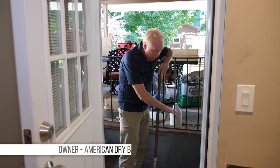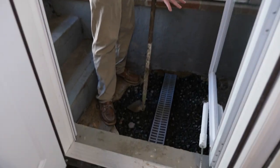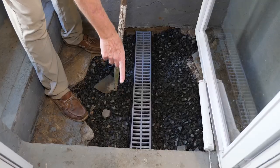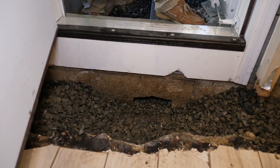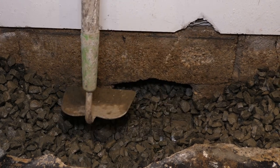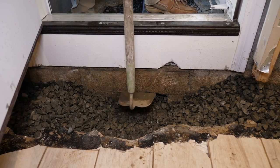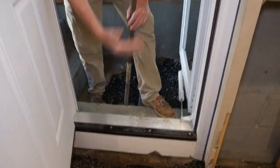What we've done is we've taken a whole big chunk of the floor out here, dug down, and filled it with an enormous amount of stone. Then we set up our speedy drain that goes through this step to the inside, tying in with a T right here to our system. So any water collecting out here, or even coming up hydrostatically, will flow through to the system, go to the pump, and be pumped up and out away from the house.